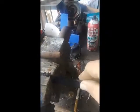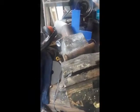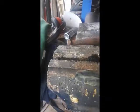After quenching, I brought it over to my vice and stuck it in while it was still relatively warm, crimped it in there to make sure there would be no warps and everything was straight. By now it should be cool enough to touch. Let's remove it out of the vice — I really like to crank it down to make sure this sucker stays straight.